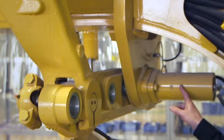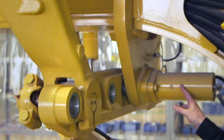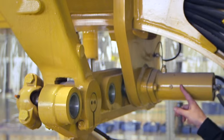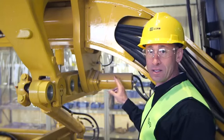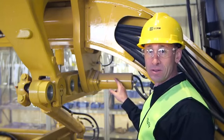In addition, unlike other motor graders in the industry, the SEM motor grader offers a hydraulic pin puller, which enables the operator to very quickly pull the pin and replace the pin once the link bar has been moved. This is fully operational from a button within the cab.